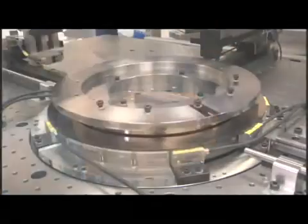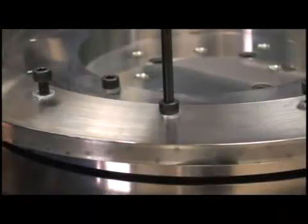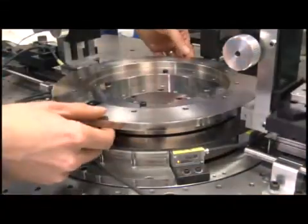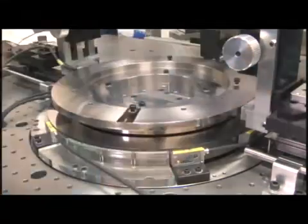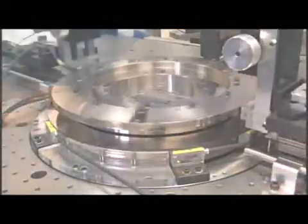REXM rings are suitable for error mapping. This is because they are very stable, so once the error is determined, it does not change, even with careful reinstallation. As an example, 2 REXM 300 rings are calibrated against each other. One ring is then turned 33 degrees relative to the other, and the calibration repeated. Each time the top encoder's error moves with the top encoder, and the base encoder error stays fixed.